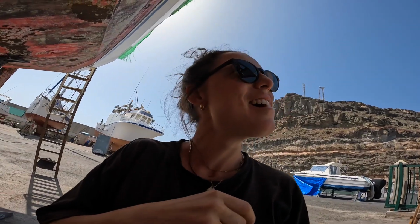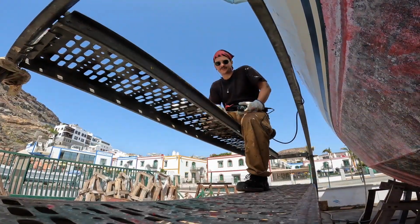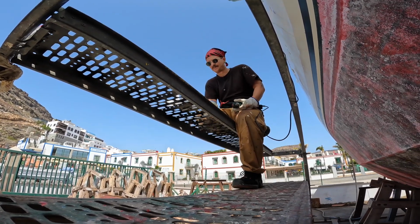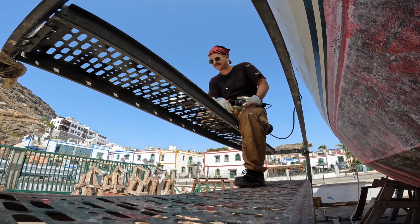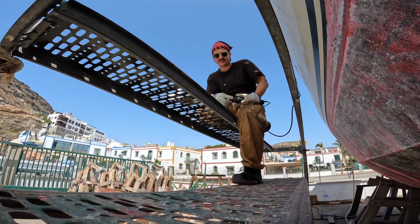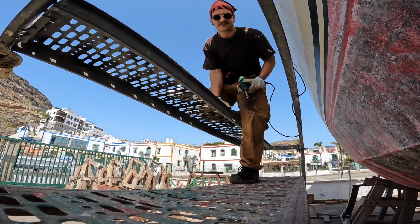Ouch. Drop of hot oil fell on me. This doesn't work. We're doing something wrong, and I'm trying to increase the diameter of the boring holes, and the chrome steel is too hard, our drills are too weak, whatever I'm doing wrong, something kills the drills.